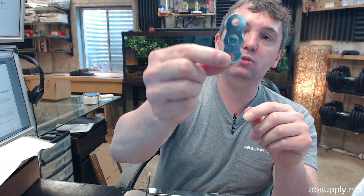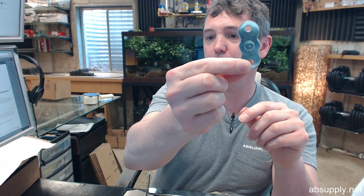I like to do the same sort of Forstner prep up in the header, because while you're never really going to see it, a Forstner bit allows an incredibly clean cut, and a flat end cut as well. However you go about doing it is great. Laziness drives my approach to this stuff, and it just happens that a Forstner bit is both lazy and exquisitely clean in its preparation. So you're going to prep the header and the top of the door for this material.